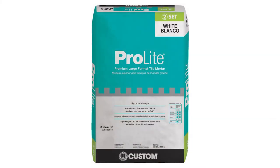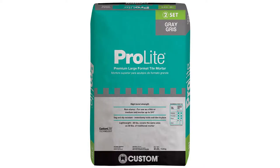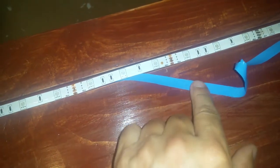You really want to buy your mortar or your thin set to match the color of your grout line, or to at least match the rock or the stone that you're using. It was a mistake using white mortar or white thin set because it got all over the stone and you could really see it. So here we have the strip light, and that's what that channel was for.